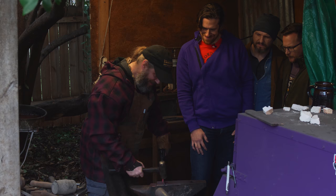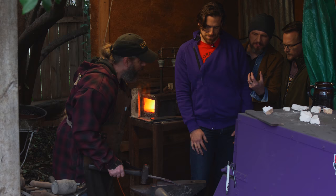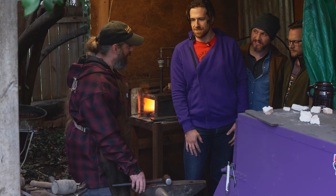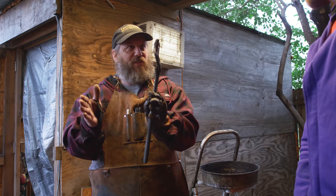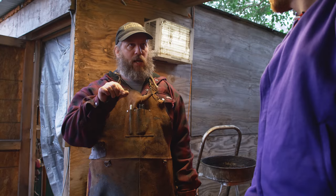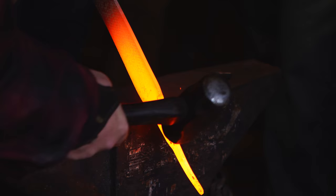I'm amazed at how much of this is just eyeballing it as you go. And for the longest time, I operated under the illusion that the handle, the blade, the hilt, and everything was all one solid piece of metal. It can be. There's a lot of different construction methods where you work the tang of the blade into the handle, like a slab handle design where you sandwich it between two pieces of wood, like we see with kitchen knives. Oh, gotcha, okay. And then there are other construction methods like this one where you slim down the tang and insert it through handle material. Sometimes you can put it all the way through the bottom and put a pommel on there, and then you peen the little nub of tang that's sticking out. Fill that all with epoxy and then you peen it closed, which creates a kind of rivet.